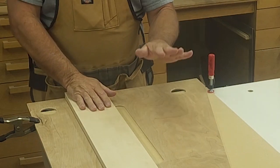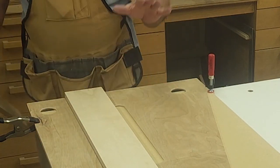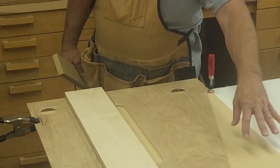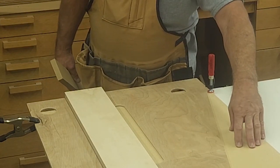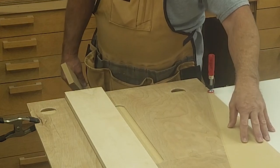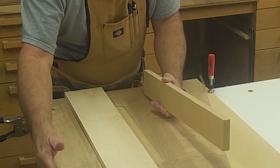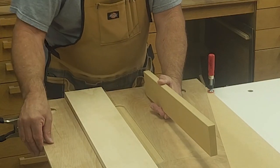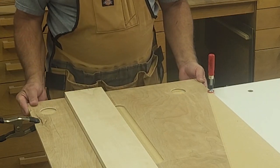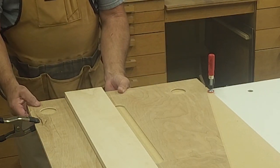You've probably been wondering how I was going to square up the straight edge to the saw guide edge. I'm using a piece of two-foot by four-foot quarter-inch MDF. I checked this every way I know how and confirmed that it is square — measuring it crossways, using the squares I have in my shop, and doing some measurement calculations. I lined up the saw guide edge to the edge of the MDF, and then this surface will just be lined up with the bottom two-foot edge.